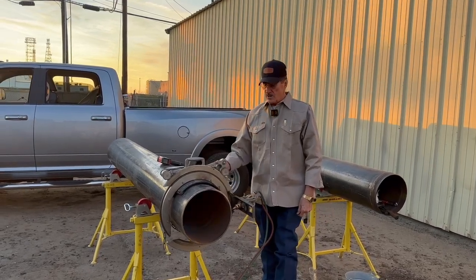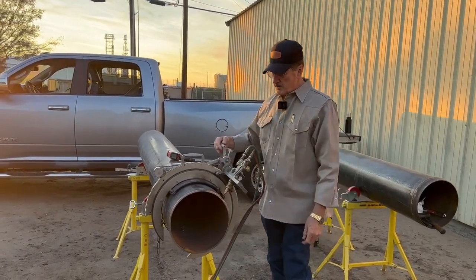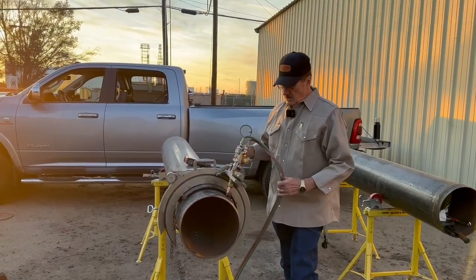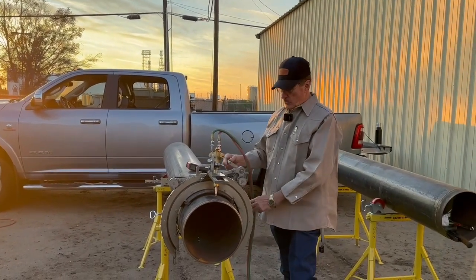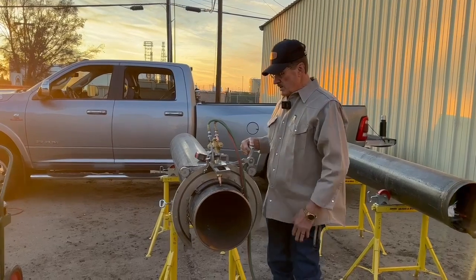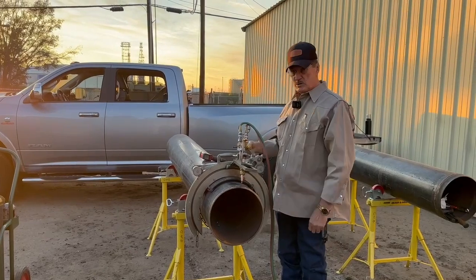That's where I found is usually the good kindling temperature. What is kindling temperature? That's when this thing will start getting orange up here. I stop after I've preheated — I'm going to stop, and it's going to start getting orange. You don't want it to get all liquidy before you hit the air trigger to start cutting, because it's going to be melting. It's going to fuse back together and it's going to want to pop when you come up here to tie in.